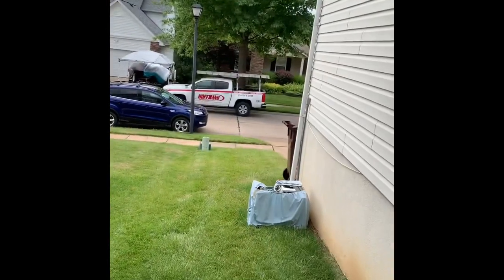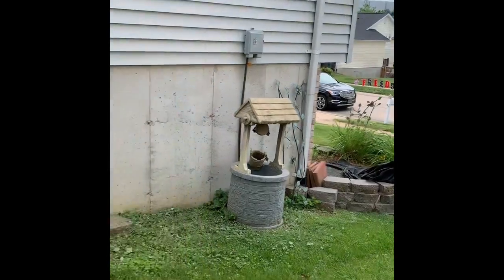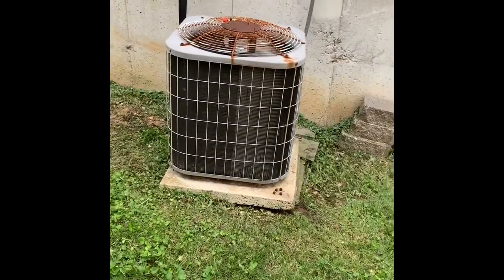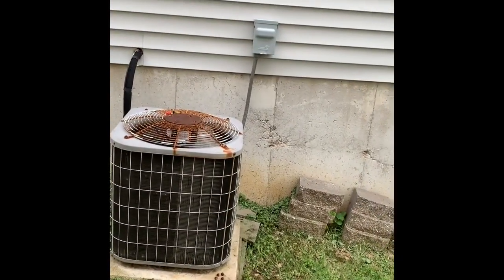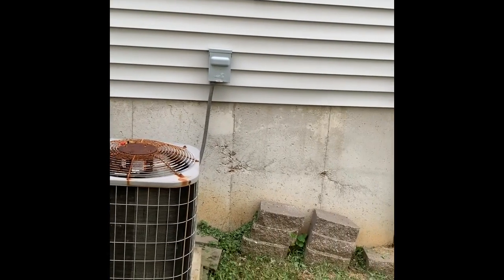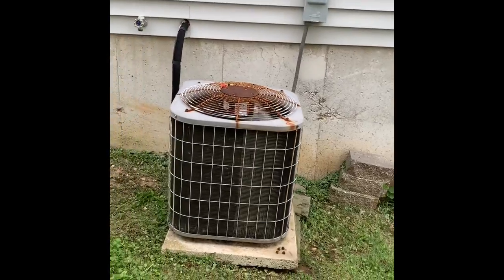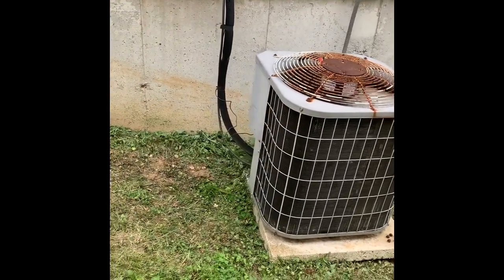Here's the unit outside. Disconnect, new whip, re-insulate the lines, and make sure you seal the fold. Easy access — there's street parking and driveway parking over here. As of right now, we're going to put it back in the wall rack, so just talk to the homeowner about exactly where he'd want to put it.